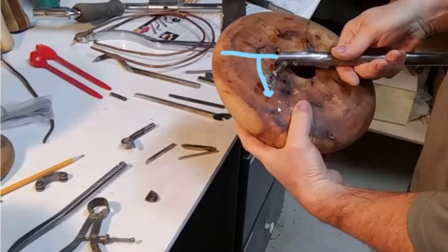That's why the Jameson's system, which relies on the backrest, which prevents the tool from tipping over, works quite well for that. However, it does not necessarily prevent vibration, and the vibration in this condition is a little bit excessive, and you have to live with that. If you want to make a flying saucer, you're going to have to live with that type of vibration.